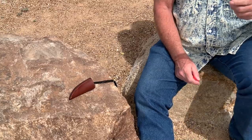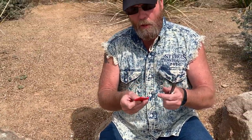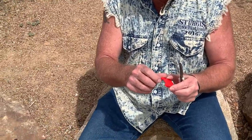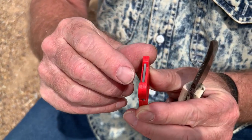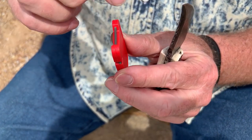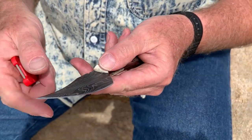This is an outside radius. People ask me — inside radius, outside radius — how do you sharpen? Today I'm going to use the rectangle, and it has the V-notch that you can slide the knife through. It's also got the open face — I call it the straight line — it's just two corners, a 90-degree corner here and 90-degree corner over there. They don't have to be very thick because it depends on the corners, not the thickness of the steel.